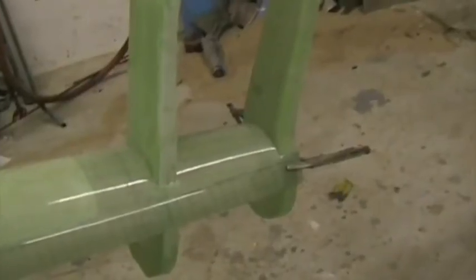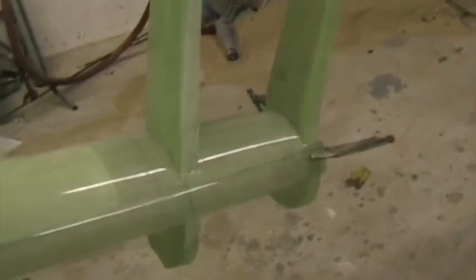There are the two spars in their approximate end positions. The rear spar worked out to 32mm wide, the full length, and the front spar is 35mm up to the kink, thereafter 32mm.